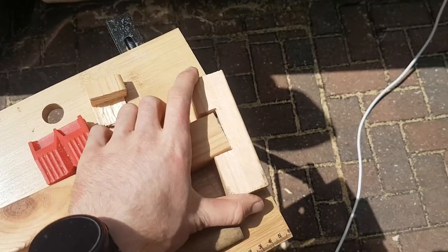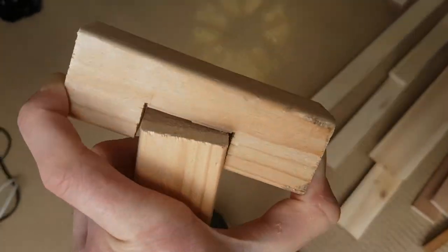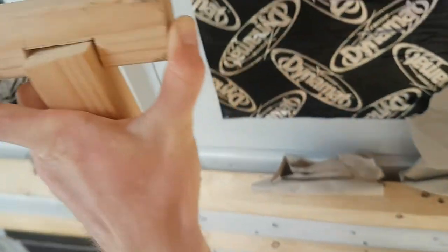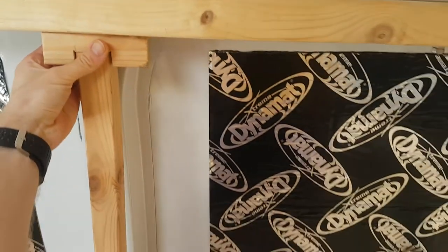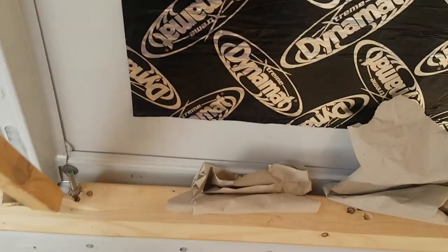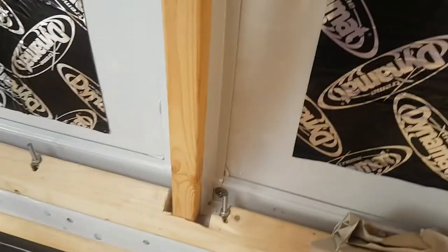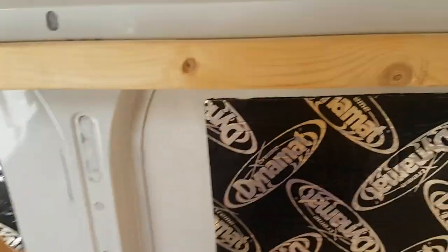I started with one at the bed end. The idea was to notch some wood to create a support and be able to screw through the grain rather than into the end, so it would be reasonably strong from both sides. I sort of did everything right up until right at the end when I just put the block at the wrong angle — instead of putting it behind the bit of wood going on top, I put it on top of it, so it didn't really do anything. When I tried to screw everything together I was screwing into end grain and just split the wood. I made a total mess of everything.